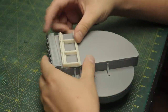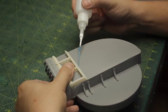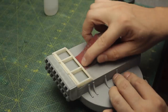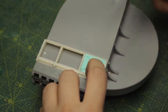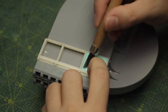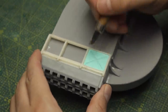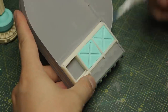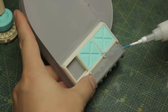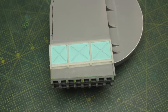It will sit right here like this - I'll attach it with CA glue to the top of the robot, then I'll close the gap at the top that's open. For each of the three gaps I made a custom 3D printed panel to go on top. It was kind of tricky to perfectly align these pieces, but eventually I got there. Fun fact: it may look like the three slots had the same measurement, but they don't - the one in the middle is just slightly bigger than the first one, and the one on the left I trimmed down so it's the smaller one.